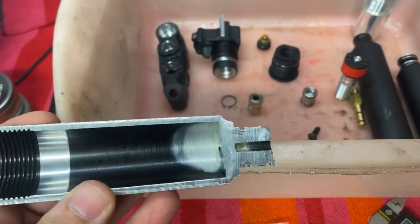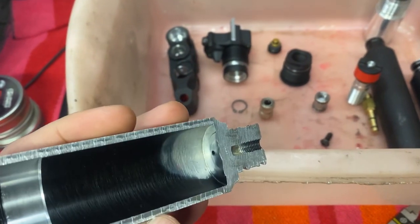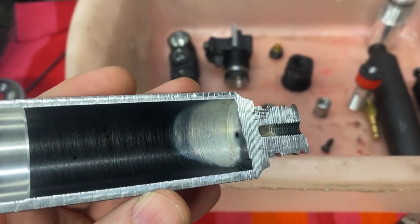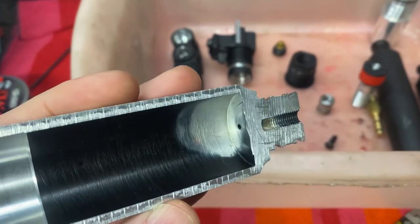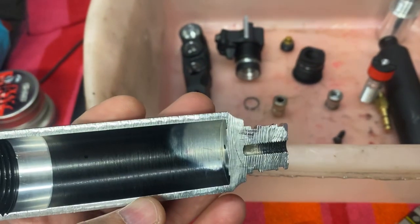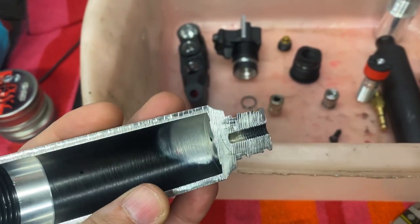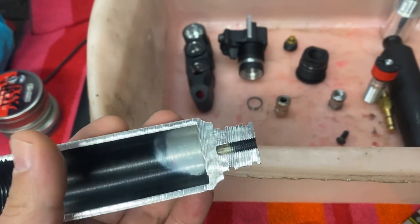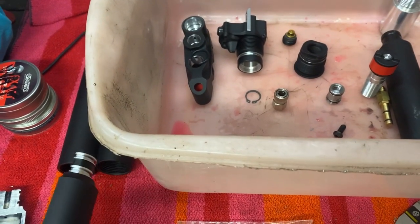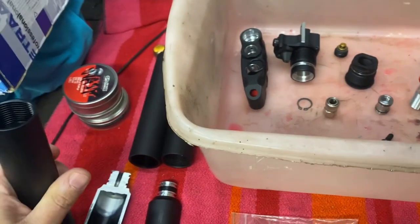This is my opinion as a hobbyist and as a mechanical engineer, that a tight, sharp corner on a pressure vessel is not a good design, but all in all it's not immediately dangerous, as the testing has concluded. The vessel can take over 700 bars without rupture, and I would be interested to see how much this vessel can take.